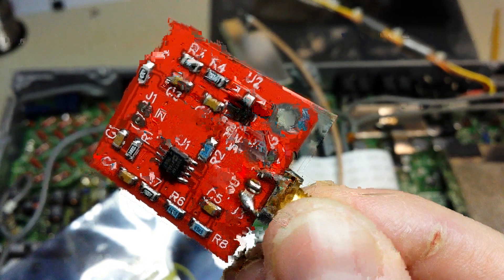Make sure everything looks good — double-check your work and confirm there are no shorts as you're putting things back together. Give everything a once-over before you fire it up. It's not the prettiest job but it's not too bad either. The filter output comes over and goes into the input of the buffer amp, the output goes to an SMA connector, then via a pigtail to BNC, right to the soft rock receiver. Then I'll show you what the spectrum display looks like after we fire it up.